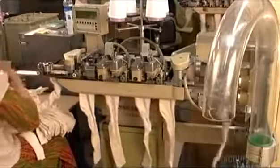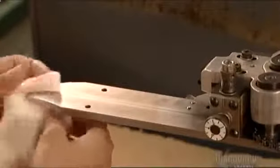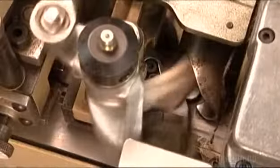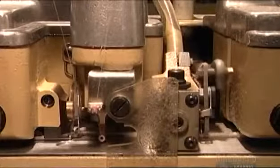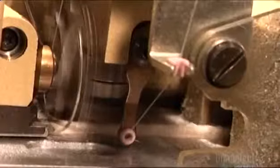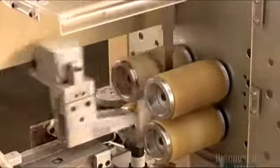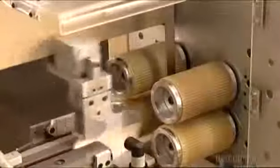But there's more than one way to close a sock toe — a more automated way. A worker slides the sock between two metal plates; pressure holds them in place. Then a motorized conveyor system transports the sock to a sewing head. A blade cuts off excess fabric and a needle goes up and down like an oil rig, stitching one row and then another as reinforcement. This automated system produces a finer seam than a sewing machine run manually. A robotic arm then feeds the sock to a set of rollers that turn the sock right side out, and a vacuum chute fires it into a bin.